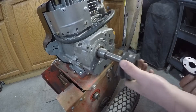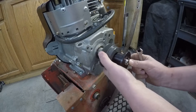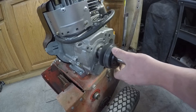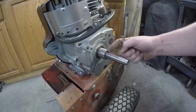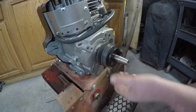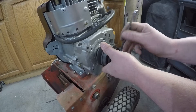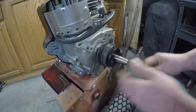The first thing you want to do is slide your pulley on, making sure that your bolt holes are facing out, and then put the bushing on. I've got to figure out what depth I want this at — I think I'm going to slide it all the way until it bottoms out against this step in the shaft. Once you've got your pulley on where you want it, you've got your bushing in and your screws started, you're going to evenly tighten them. You don't want to get this cockeyed — just go a little bit at a time on each one.